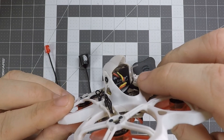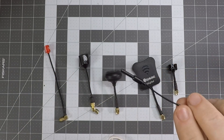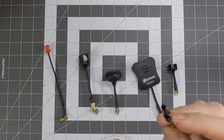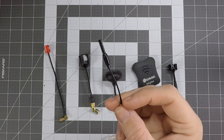But I think none of these are the best bet when you're running micro quads. I think this sleeve dipole is the best antenna for your Rapidmix, Rapidfire, or any mixing receiver. If you look at what's actually in the Tiny Hawk — way back in the back there — that's the VTX antenna. You'll notice that VTX antenna is actually laying on the quad horizontally, and what it looks like up close is a sleeved dipole linearly polarized antenna. It's one of the simplest forms of VTX antenna you can get and is very commonly found on micro drones.